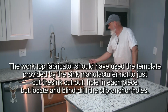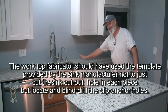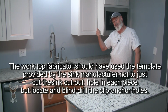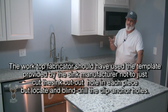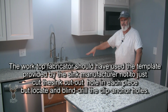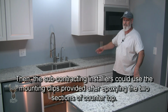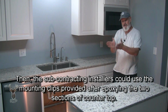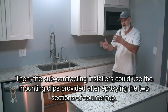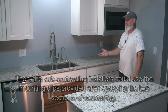And we don't have to then fight going up underneath between that fairly small space between the sink and the cabinet to fight up where we can't really look good from underneath the bottom to get our tool up there to tighten them down anyway. So it's just easier to drop that sink down, skip all of that process, mix up some epoxy, run it around the top of the sink, push it up into place, scab a 2x4, maybe with a little post on the bottom, scab it up there to hold it into place, run some screws in through the walls and call it good. When that epoxy dries, that's not coming off.